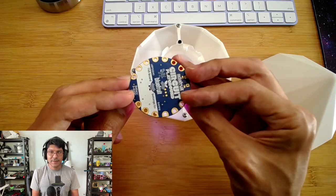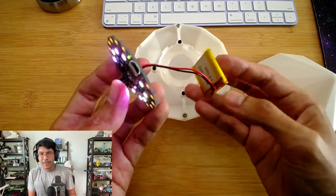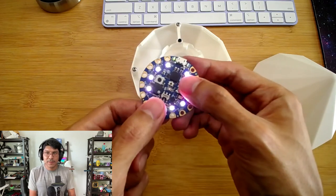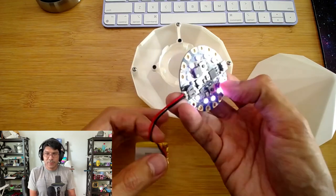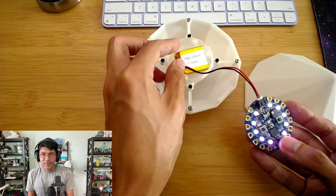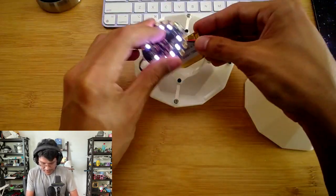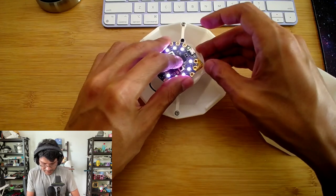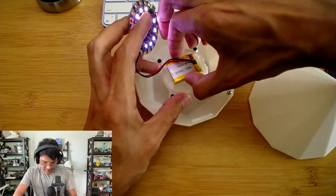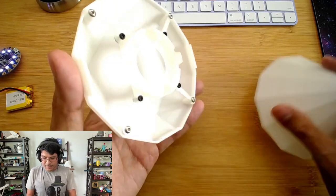Really great little piece of kit — the Adafruit Circuit Playground Bluefruit. It's my favorite because it's got the Bluetooth chip, the nRF52840. You don't have to solder any NeoPixels because they're built in. You have capacitive touch pads, an accelerometer, and a built-in speaker if you want to do some fun stuff. For the battery, it's just this little 500 milliamp LiPo battery, and it fits right in between the standoffs. Check out the links in the description if you want to purchase the Circuit Playground Bluefruit or get notified when they're back in stock. The way this fits is you just have to massage it in between the standoffs.